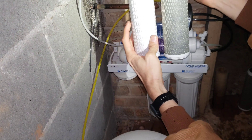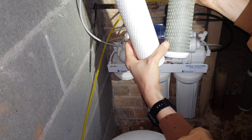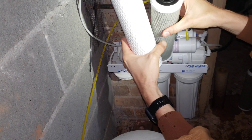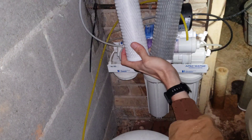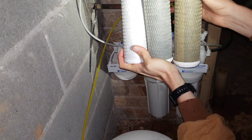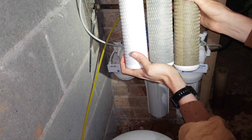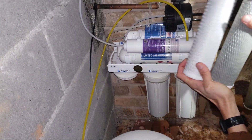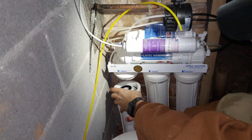Here's the new carbon filter. Comparing it to carbon filter number three, you can see the new carbon filter is quite a bit brighter white, though that's partly because the used one is wetted and you see the black from the carbon behind it. The key difference is that the first carbon filter has a lot of red sediment in it, while the second one hasn't gotten very dirty. We take the last carbon filter and stick it in.